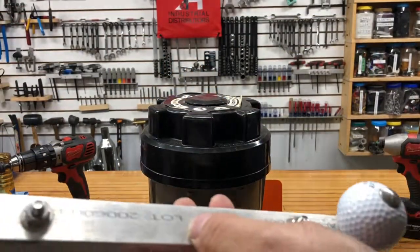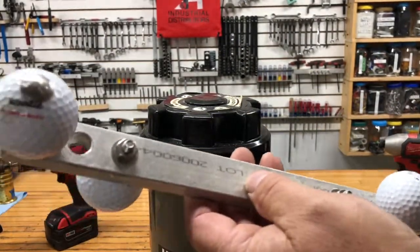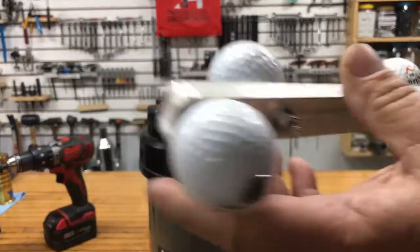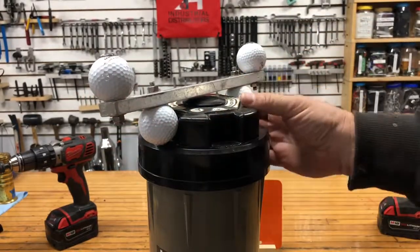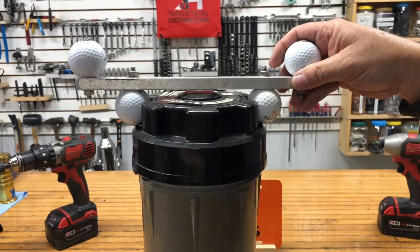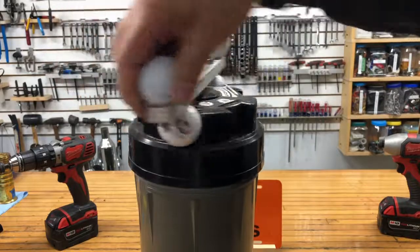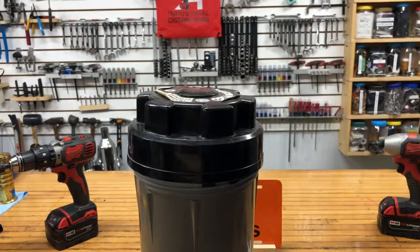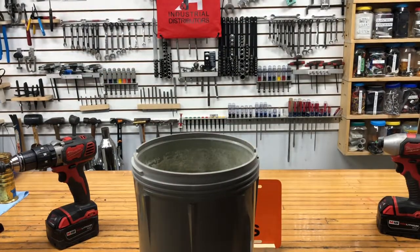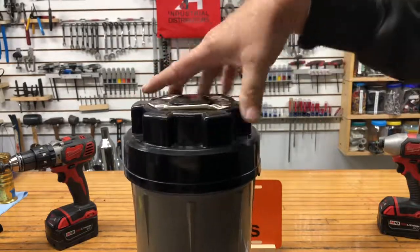So how this works: the two closer balls are six and a quarter inches apart, and the other balls are just to the end, a half inch from the end. The inner balls go into the notch of the chlorinator cover. With the balls being a little farther apart, it gives you a little more mechanical advantage to open it. That way you don't have any hex nut or hex bolt in your hand when you turn it — makes it more comfortable. Once she gets it loosened, you can just spin it by hand, add her chlorine tablets, then spin it by hand until it gets tight.